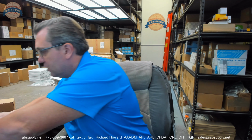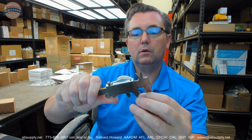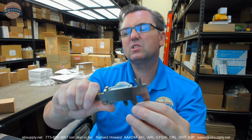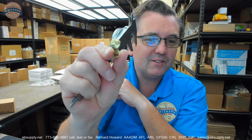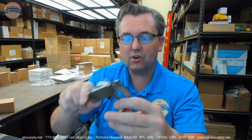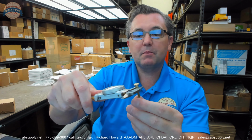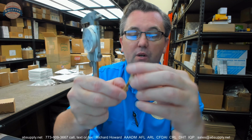Couple of additional dimensional properties on that. The outside diameter of the head, 0.426. And again, that's a one-way, a slotted one-way. If you ever try to remove those, people look at that and feel that it's not tamper resistant. I assure you it is. I've tried to remove those. It's a lost cause, in my opinion. The diameter of the body of the female portion, 0.25, 1/4 inch, right on the nose.